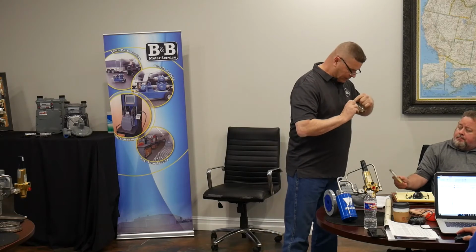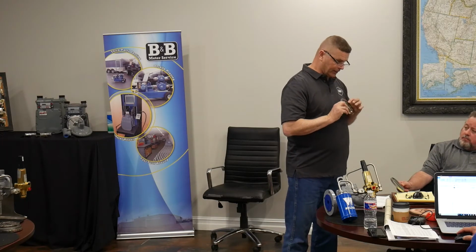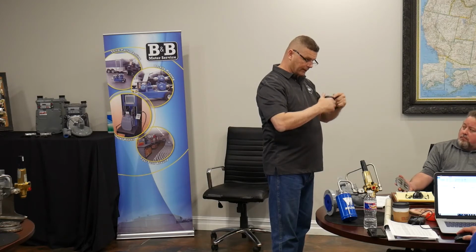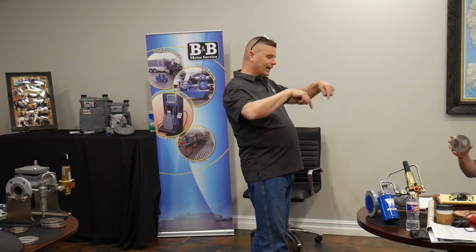Now, I want you to look at the area closest to this bridge where this can go on, because it's reversible in this size. So it doesn't matter which one I pick as inlet or outlet, they're both basically shaped the same. But the ones on the innermost area closest to the wall are nozzle. So it basically has a shape where it gets smaller as the gas goes in. What this does is two things. First of all, when the diaphragm peels away, now it's only exposing one row of the downstream side, not whatever else is exposed from the slot, and not restricted by the weld. So I have a tremendous amount of control over the low flow.